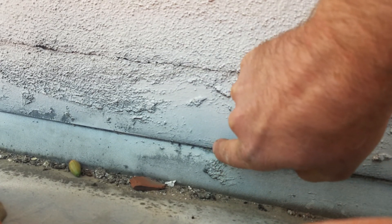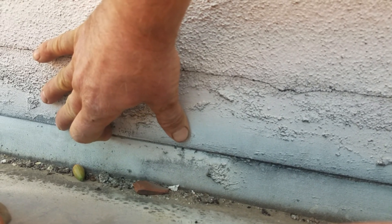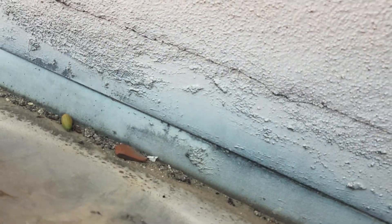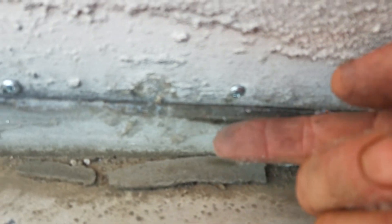There's a little tiny bit of looseness. I'll run some sheet metal screws into that flashing — it's one piece of flashing to the next. I peeled it open on that edge and packed the silicone up in between the two pieces of flashing.